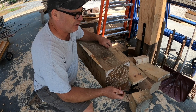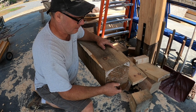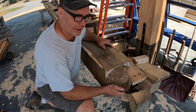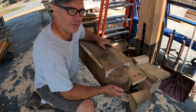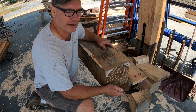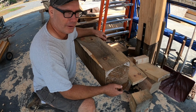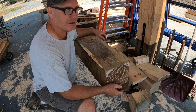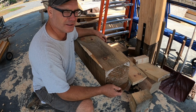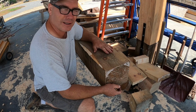When I started out, I also did some barn restoration. In doing so, I worked on a barn that I guess they called a slung barn. It had a truss built into the roof, and there were metal rods that supported the first floor. They hung from the truss. In repairing that building, there was considerable rot around all the metal, because my theory is that water condensed on the metal and ran down the steel rod and rotted around the fastenings in the timber.